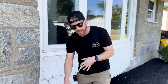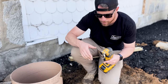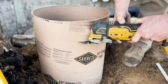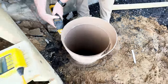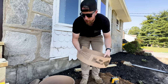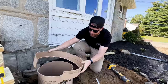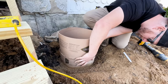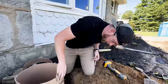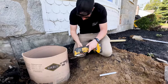This one needed to come down 15 inches off the top, so I've made three marks around the outside, 15 inches down. Now to get a nice clean line around a circle — it's pretty tough. What I do is cut off the top of your tube, make sure you trace it with the factory flat side, wrap that around the tube and you've got your mark. Now we've got a nice clean line all the way around. Let's go cut it.